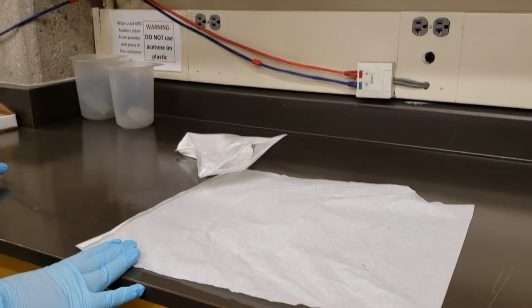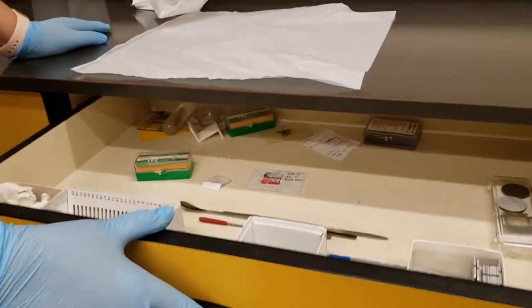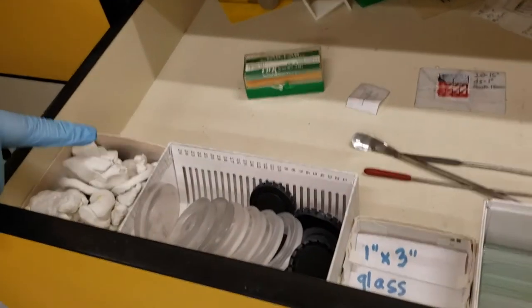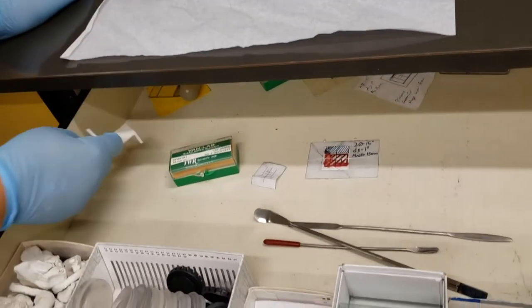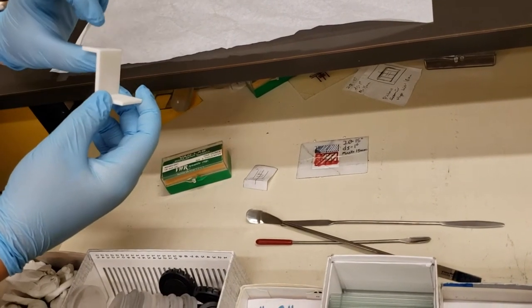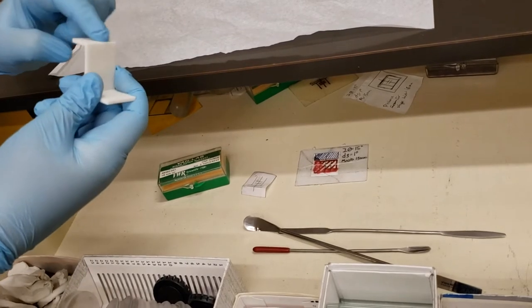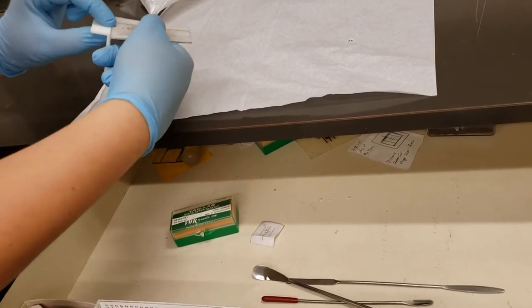Back on the counter, directly in front of the Expert XRD, we are going to prep our sample now. There is a drawer here labeled XRD sample prep. Inside we have glass slides, spatulas, and other tools. This right here is clay, which we can use to mount our sample. If you have a sample mounted in epoxy resin — something about an inch thick, a solid rather than a powder — you can use this to mount your sample into the Expert. You would leave the clip attached, clip onto here, and make sure that your sample aligns really nicely with the top of this plastic piece.